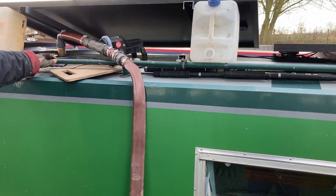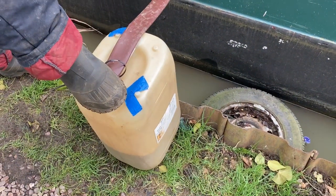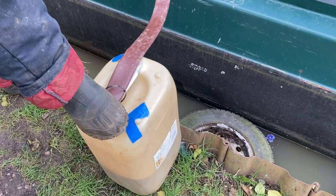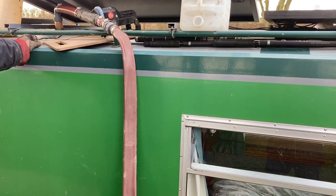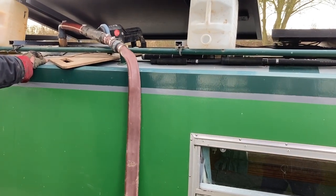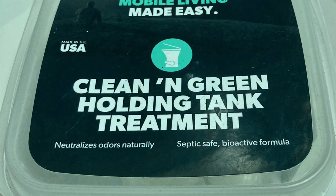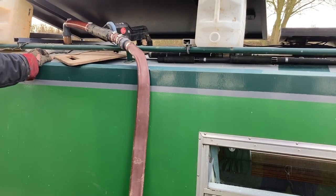So here we go, we're pumping the boat. You can see through the sight glass we're all good — we can hear our pump working and our drum is filling up nicely. It's a little bit of a pong, but it's not too bad. We actually use a biotank treatment that actually digests the human waste and really does sweeten it up a lot. It seems to be a lot better than the chemicals. I'll show a picture of what we use at some point. She's pumping away nicely — it doesn't take long.